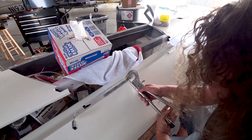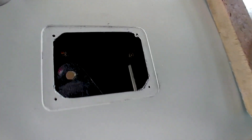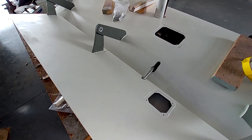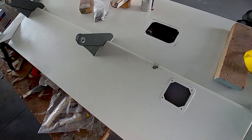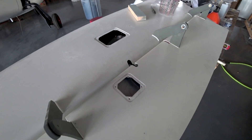Now that the nut plates are all done, the ailerons can be bolted onto the wings — we're just waiting on the wings to be finished. Here are the bell crank assemblies with the push rods. I put the final hardware in there; a little bit of tape was just to hold the washers in place between the arms of the bell crank. I got the travel I'm looking for and the action is nice.